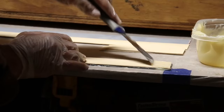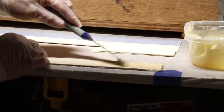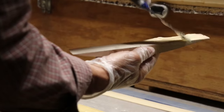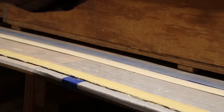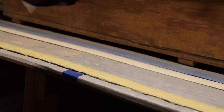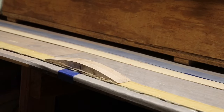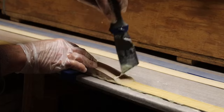The next step is going to be your wedges and your riser, then the other laminations to follow. Just take your time and make sure everything's done right — no dry spots. Make sure you center that up good; you don't want to put it down and then have to smear it left or right because you'll remove glue every time you do that. I apply a lot of extra glue at key union spots where the laminations have to bend around the handle and adhere to the back laminations and around the wedges.